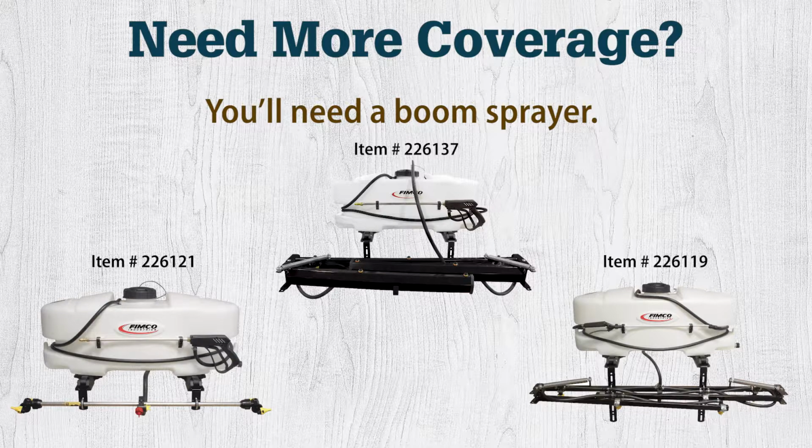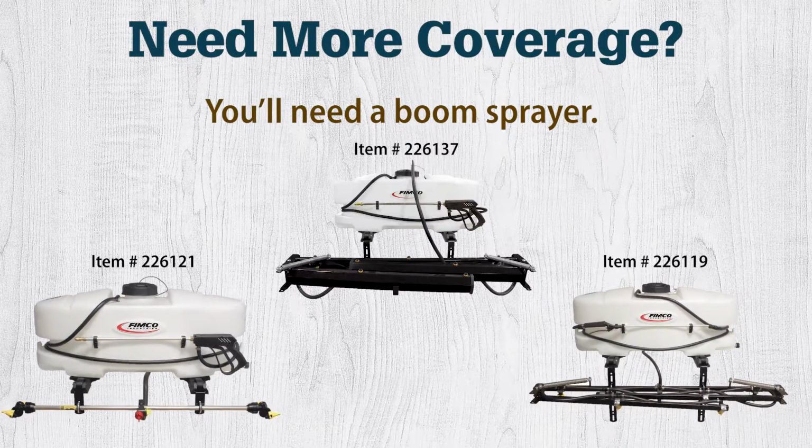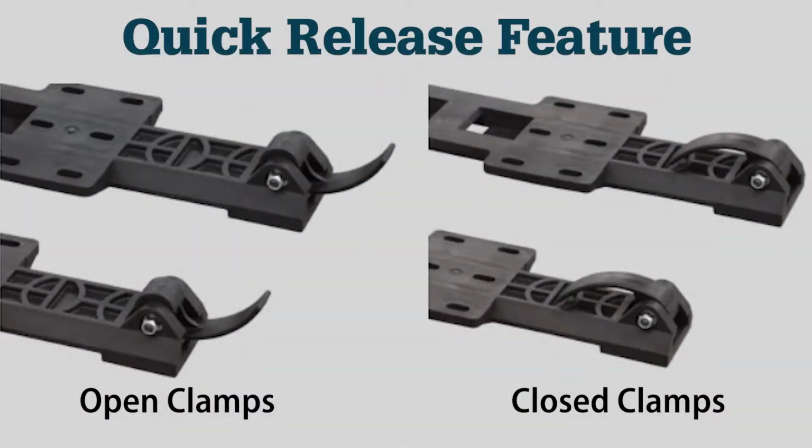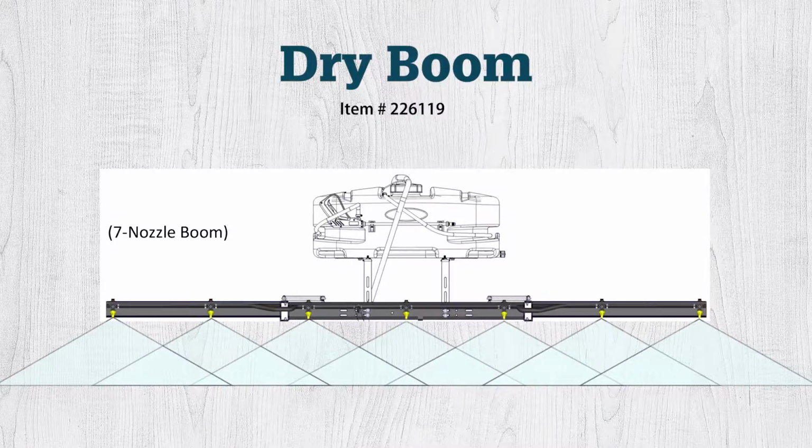You will generally have 3 boom styles to select from: dry boom, wet boom, and dripless boom. All boom sprayers have a quick release feature that lets you attach the boom when you need it and easily remove it when you don't. A dry boom carries material through poly tubes to the nozzle. The tubing and nozzles are then attached to a steel frame to provide the rigidity.